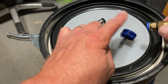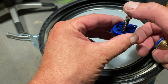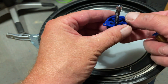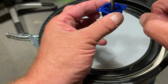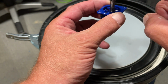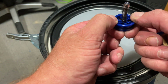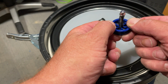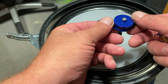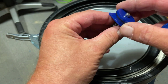So let's do the connection for that first, the hole for the air admittance valve first, making sure you get this the right way. It's also going to be pressured, so that is the correct way up, so it can take air in when you're draining the filters for cleaning, but it will not let water on the pressurized system burst out of the filter barrel. I suppose if you want to, you can do it the other way, bearing in mind that you are going to be filling that with air. So we'll try it that way first.